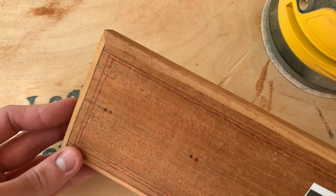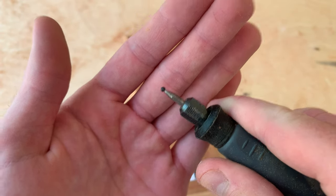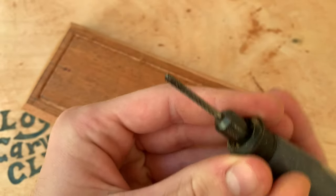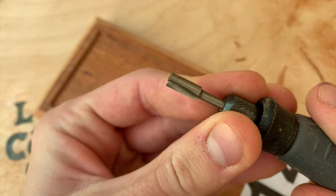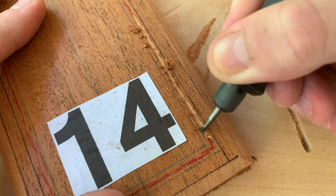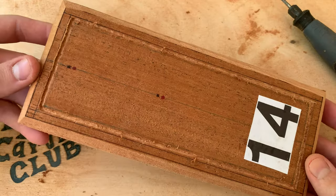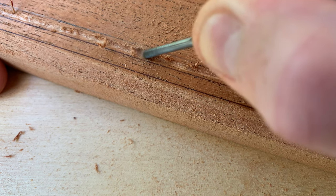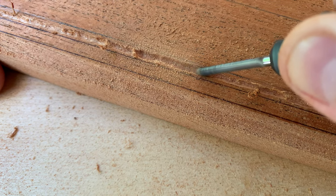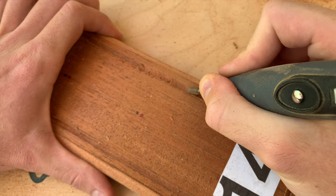We can get to the epoxy border now. I'll cut that out with these three bits, since I really want it straight. I'll start the cut with an engraving piece to try and get the straightest line possible started. I'll then make that a little bit deeper with the 562 tile cutting bit. And to finish the groove, I'll use this router bit to even out the cut. I used all three of these at 30,000 RPM. I'm shooting for about half a centimeter in depth for the final groove. By the way, everything in this video from the hardware, to the wood, to even the felt I'll put on the back at the end, I got from Home Depot. So you can absolutely get all this from probably any big box store. The only exception is I got the epoxy on Amazon, but that's probably also at those stores, but I'll link it in the description just in case.